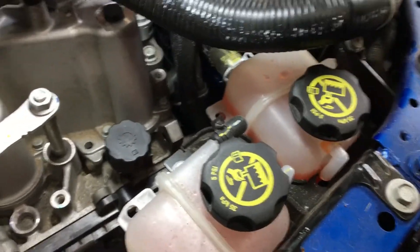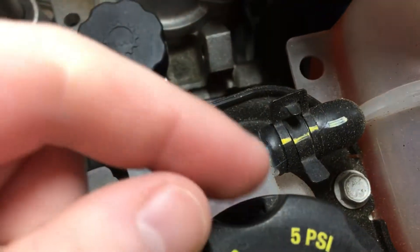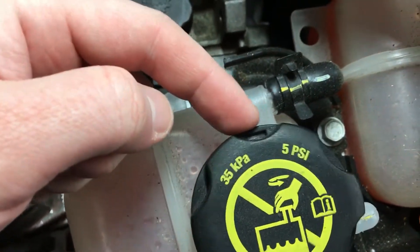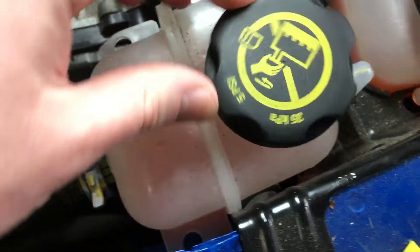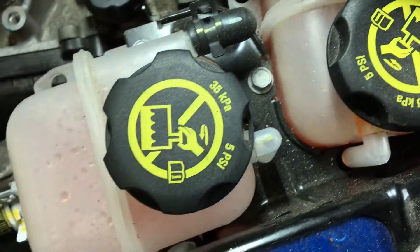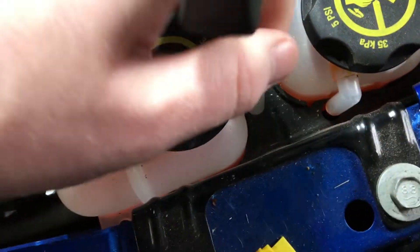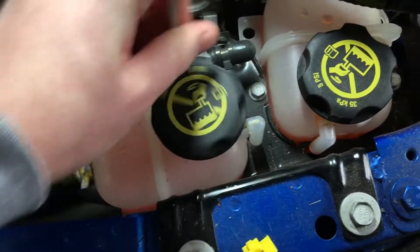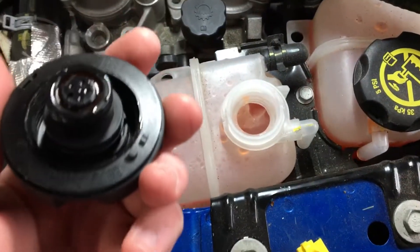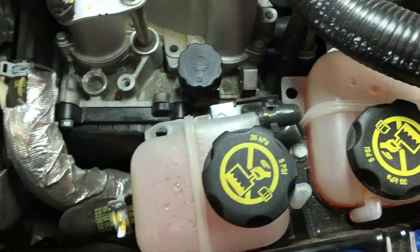First I'm going to show you how to remove the cap itself. The cap has a little notch — a little slot in one of the knurls. Turn it until you can see through it, just like that. That's the bottom cap; it's an inner and outer piece of a ratchet. Take a flathead, drop it in there, and give it a turn. That links the inner and outer cap, and it just screws off. You don't need anything to screw it back down because it ratchets that direction — just tighten it back down by screwing it.